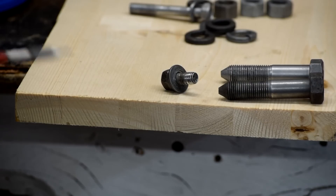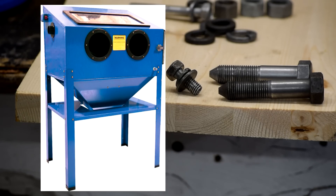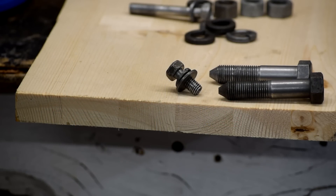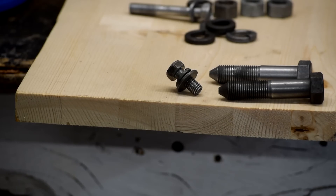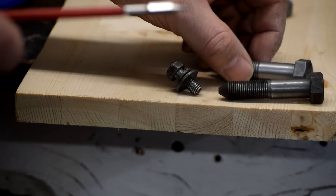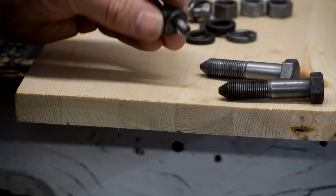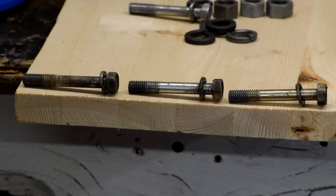The question this poses is how is this any better than just running it through a wire brush or hitting it with a bead blaster? The difference is that to run a bead blaster you need a bead blasting cabinet and an air compressor capable of feeding one — not everybody has that. So if you're short a bead blaster and need to clean rusty bolts, the vibratory polisher and Evaporust together make a pretty good combination. And given that most of it is unattended, it's nowhere near as much work as feeding things one at a time into a wire wheel. Looks like I can't leave well enough alone, so we're going to try this again.